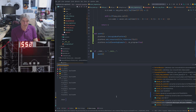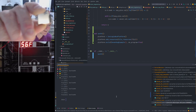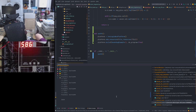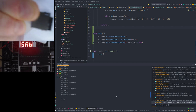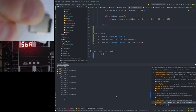So one of the ideas I had, a couple of years ago, was to use these card connectors as a socket. Why would I use these? Well, the answer is the surface mount, so I don't need any soldering, which you have to do with PMODs, which is a pain in the ass, by the way, and increases the cost because it's an extra process, can't be done with the original reflow.